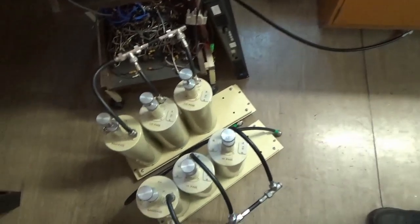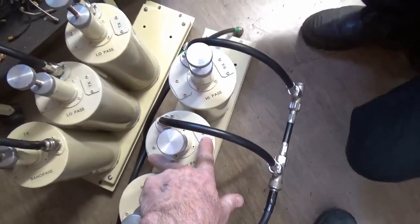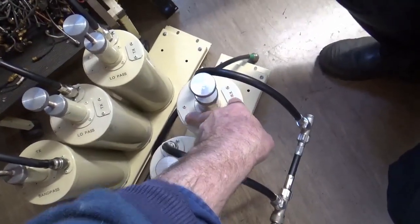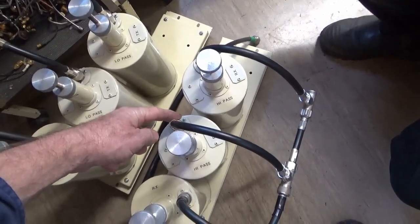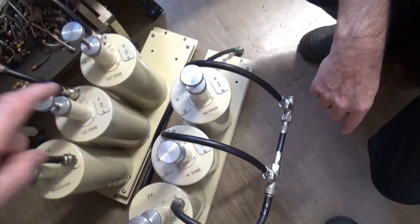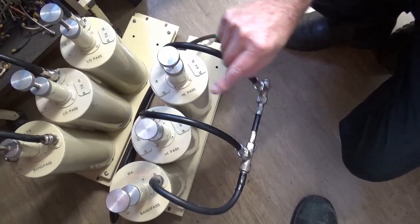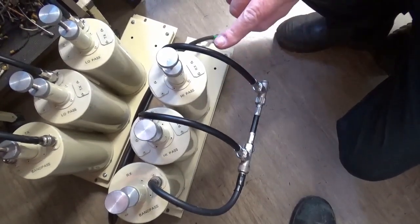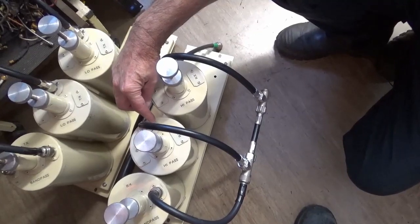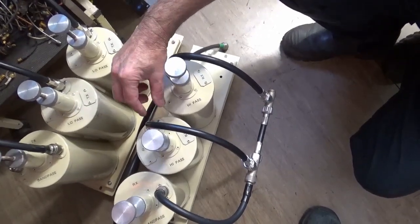The other two are arranged as what's called a T-pass or a notch filter, so you'll notice there's no in and out. These two ports that appear here were in there and in that can. I've drilled another hole in each of these cans and in there is another pick-up loop — a loop of copper strip about 45mm long. It's soldered from the center pin of the socket around in a loop and soldered back to the ground or earth part of the plate — a small copper washer that the socket is soldered onto, and that whole thing is soldered together.